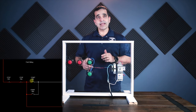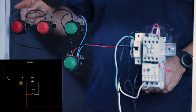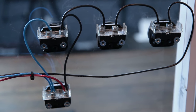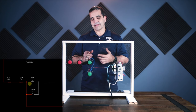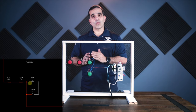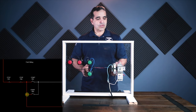I have my two start buttons, and if you see here I've laid them out this way so you can see the stop buttons are in series with one another. Power needs to run through the first one and then through the second one — both switches have to be closed for power to continue. That is a series circuit. Then we come to the start buttons, and I've put them in this configuration because start buttons are wired in parallel.